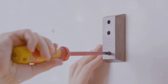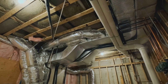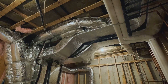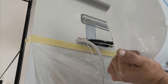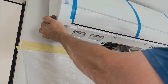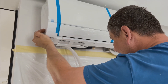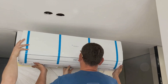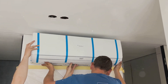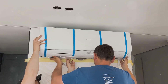To mount the unit, just remove a Phillips head screw to detach the bracket and determine your wall placement. Slowly bend the piping to a 90-degree angle. If mounting near the ceiling, keep it six inches below for optimal airflow — some users manage with about four inches. With the bracket in place, mark and drill the hole for the piping and wiring. Use the provided level to ensure everything is correctly aligned. The included stud finding magnet tool is extremely helpful; it works better than electronic stud finders, which can sometimes be inaccurate. Once the hole is drilled, you're ready to mount the head unit permanently. Make sure everything is secure and double-check your work for any adjustments needed.